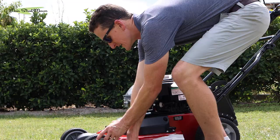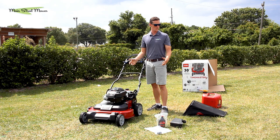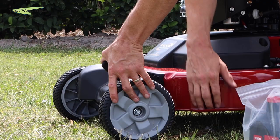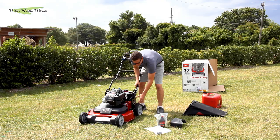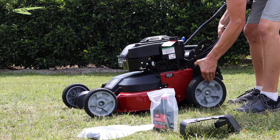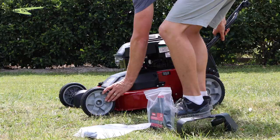Moving down to the wheels for adjusting your height of cut. This mower cuts at four and a half inches — that's the A position, which is quite high, much higher than anything 21-inch on the market. When you change one side it changes the other side of the front. There's a lot more weight in the back, so the best way to do the rear is to take some weight off and let the weight squash it down. You do have a spring-loaded rear axle to help it go up.